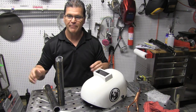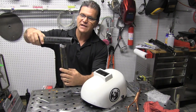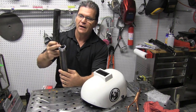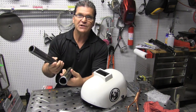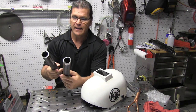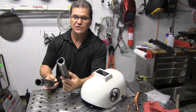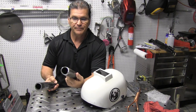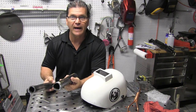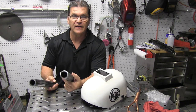Here's an example. I welded a joint similar to this a few weeks ago — kind of a joint you would see on handrails or a roll cage, a little coped joint. This is just inch and a quarter schedule 40 pipe, also called black iron pipe. It's got a coating on it that prevents rust and corrosion. You can't TIG weld over that and get a decent looking TIG weld — it's going to bubble and spew. TIG welding just doesn't do well over stuff like that.